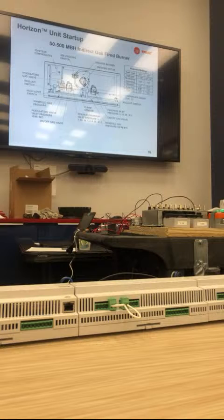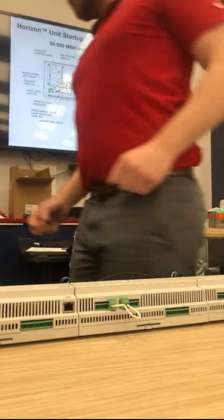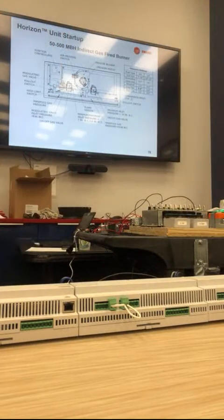So there's a period of time where maybe we can get down to a 10 degree rise on that modulating side, but it takes a period of time to get there. And by that point, the unit may already make adjustments. Basically, when we turn heat 2 on, it takes 3 to 5 minutes for everything to stabilize. Because of these tubes being hot, these tubes being cold, you've got about a 5-minute adjustment before the PID kicks back in.